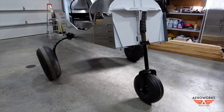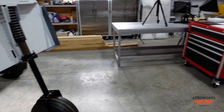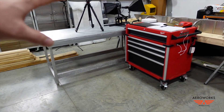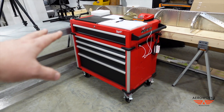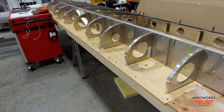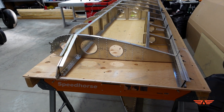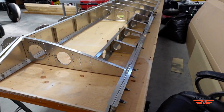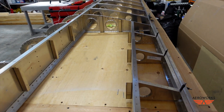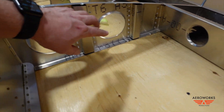Let's take a look around the workshop. The Super Duty is sitting on the gear, and we've been moving things around and getting things sorted out. I've got a couple benches here for small parts layout and riveting, my main roll-away toolbox with all my riveting tools. The right wing is up here on the table — assembled over about a solid day of work. A lot of it is still Cleco'd together, still getting parts fit up and sorted out, though some of the riveting is done.